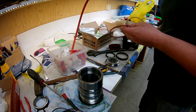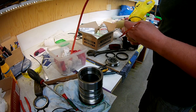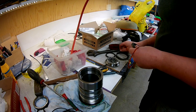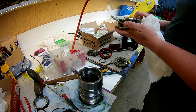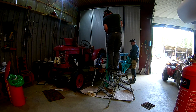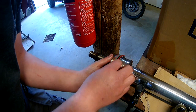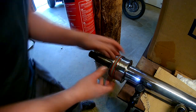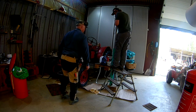I had the old seal pieces still in a box, so they were looked at. On the new seal it says the support rings have melted — I think something has been running plenty hot there. I think that seal is too tight for this application, causing excessive heat. I did try installing with just the old seal first and it was super easy, but with the new seal I get plenty more resistance moving it up and down.